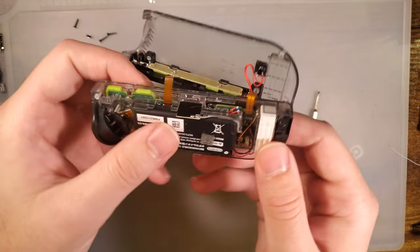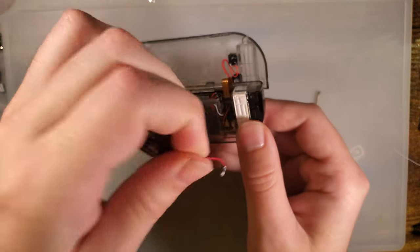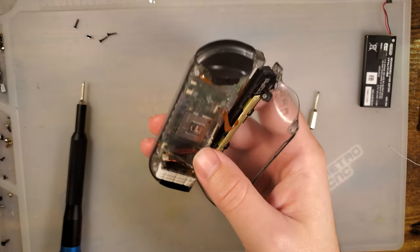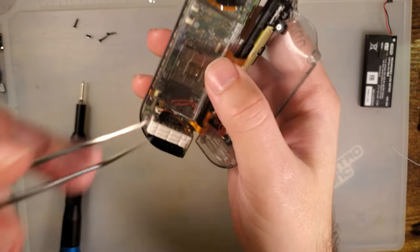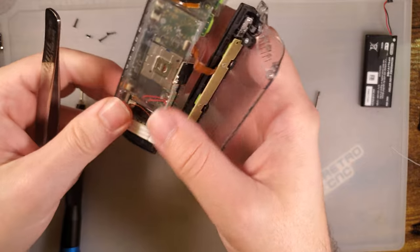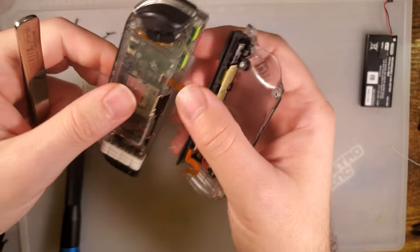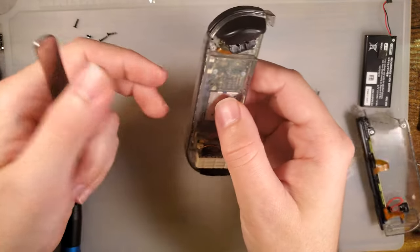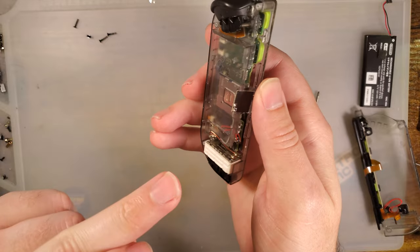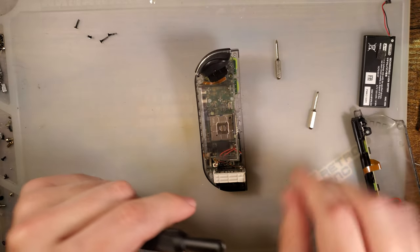So it turns out that the Joy-Con does not actually use a fuse. It does indeed use a 0-ohm resistor. But that is not the whole story. The Joy-Con uses a 0-ohm resistor because they simply do not make fuses in 0201 size parts. Now, I don't know the specific reasoning behind using a resistor instead of a fuse. All I know is that in this particular circuit, there is a 0-ohm resistor used for its fusible properties,